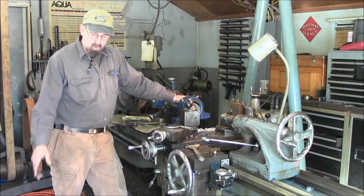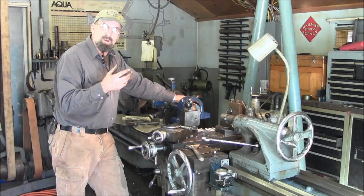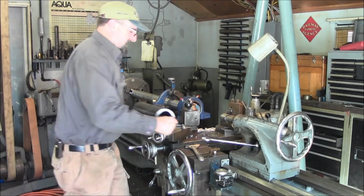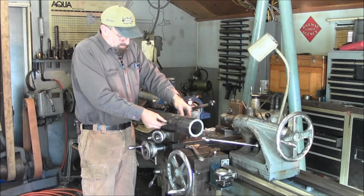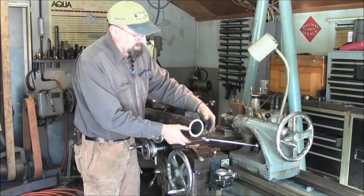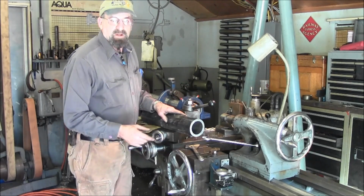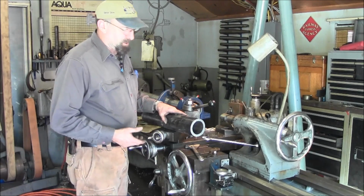mechanical tubings, and we're going to bore those to be clearance plus a little bit extra clearance for the weld contraction of two seams running down the side. This is the mechanical tubing. This is one of two of the short ones, so we have one long one. And they are going to have a weld bead running along the side here, which will draw in here and squeeze this together and open it up this way here. And when it squeezes together, we have to have clearance because they want to slide this pin through whatever they're attaching these to.